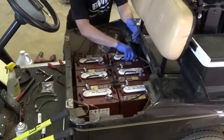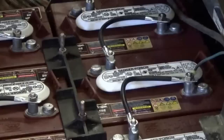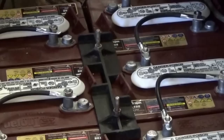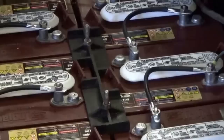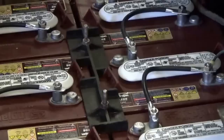There's an extra cable that comes off the back wall here. That cable isolates two batteries in series to make a 12 volt system — that's how you run your lights, horns, stereos, and accessories. When you run a lot of accessories such as stereos, loudspeakers, and amplifiers, you're really going to wear on those two batteries. I recommend at least once a year you isolate or rotate two different batteries in the cart, because you're discharging those two batteries very fast compared to the rest, causing them to age quickly and hurt the entire battery pack.